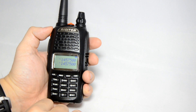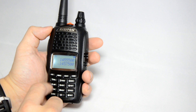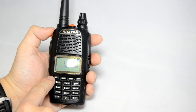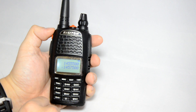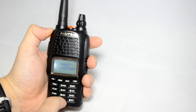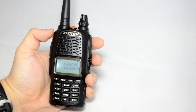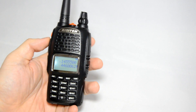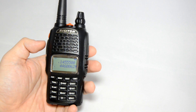What you saw there was single band operation, so the radio will only work on one frequency. However, if you press the TDR button that brings the radio onto dual band, so you can have two frequencies. You now have the A and B key working — frequency A on 145.550 and frequency B on 145.75. That can be changed directly to a UHF band. When you transmit, it momentarily shows the split, displaying what you're transmitting on and what you're receiving on.